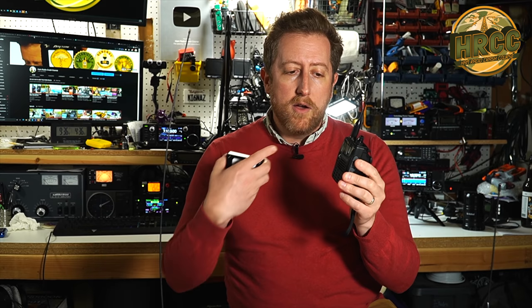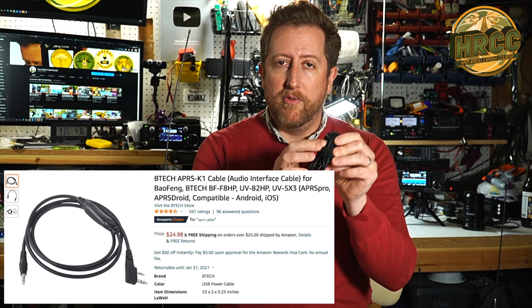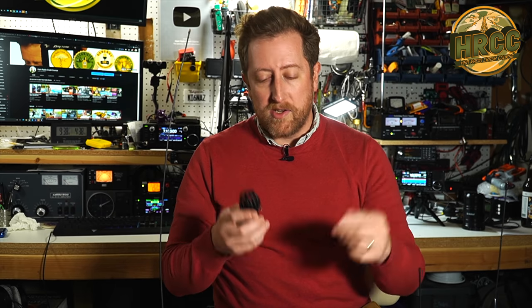With the Kenwood radio, for example, I needed a bit more audio into and out of the radio to get it to work effectively — simple, just connect it to my phone and go crazy with the sliders. At the time of recording, the MobiLinked is selling for about $120. Coupling that to a $25 Baofeng plus a cable for about $20 — or you can homebrew the cable to save money — you need to go from the headphone and microphone jack on the Baofeng into the 3.5mm tip-ring-sleeve connector on the device.